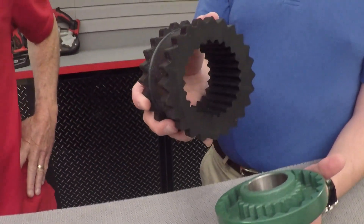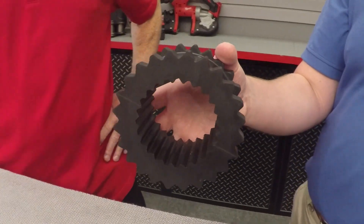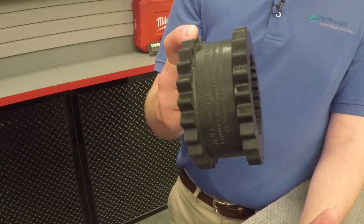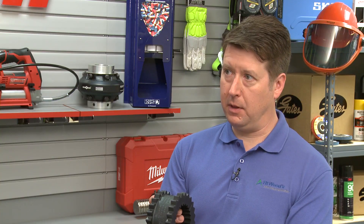This is the TB Woods SureFlex Plus, a true TB Woods innovation. TB Woods invented the SureFlex coupling over 60 years ago and has recently made significant improvements to this industry-leading sleeve coupling. New SureFlex Plus EPDM and neoprene rubber compounds have enabled a 30% higher torque rating on all sizes. The higher ratings allow many common applications to use a one-size-smaller coupling, yielding an average 25% cost savings. Size for size, SureFlex Plus sleeves last three times longer than lower rated couplings, reducing downtime and lowering maintenance costs.